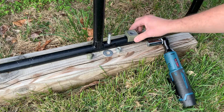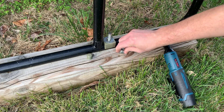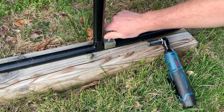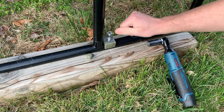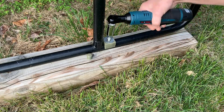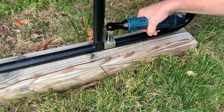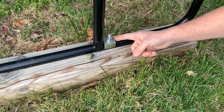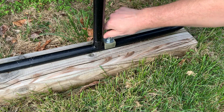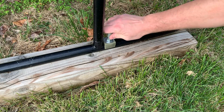So this is the first piece, and this follows the curvature of the pipe. We drop this guy down on top, our flat washer goes next, and then our nylock nut. I'm going to tighten that until it just starts to compress — that gives me a little bit of flex so we're not binding up. And then this top cap not only protects that threaded rod from rust, but also makes sure we don't have any sharp edges at the top.